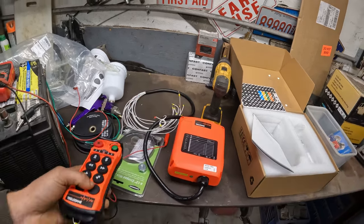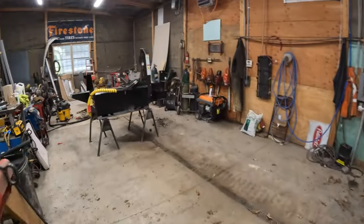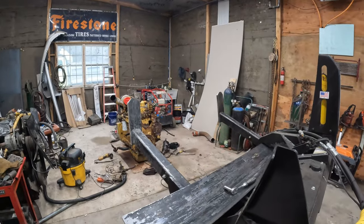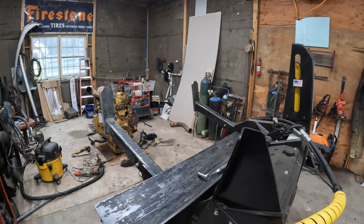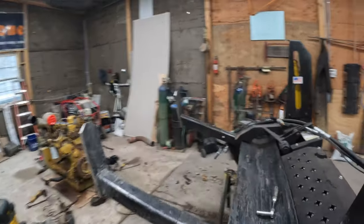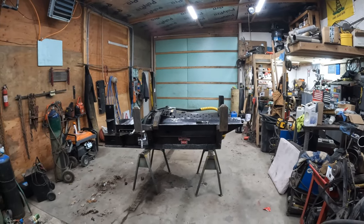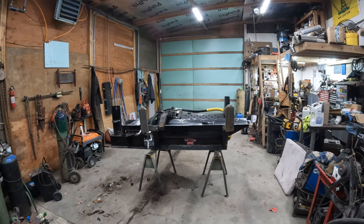The reason behind this is when the processor is mounted on the skid steer, you have to physically scoop each log up with these little forks here. A little bit annoying. Hard on the undercarriage of the skid steer because you gotta constantly twist and turn. The way this will be is I will be able to sit over here with the excavator. The skid steer will stay in one spot. I will be able to run every function of the processor from the cab of the excavator.